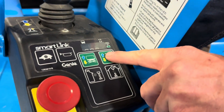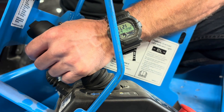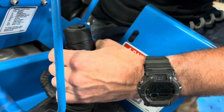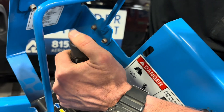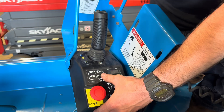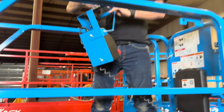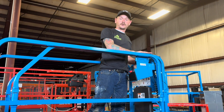When you switch it over to your travel mode, hit your travel button. Dead man in, hit and hold, then forward — and back towards you for reverse. You're going to notice you have a rocker right up top — you're going to steer off that top rocker, so left steer and right steer. This turtle symbol indicates your travel mode and you can put it in a low travel speed. You also have your horn up here. When you're done moving the control box around the platform, always put it back in the platform control position.